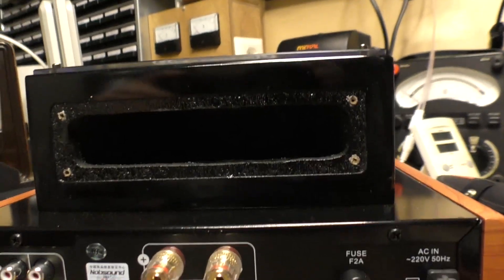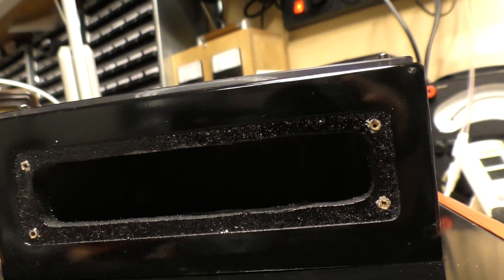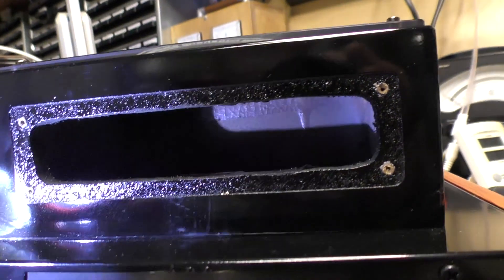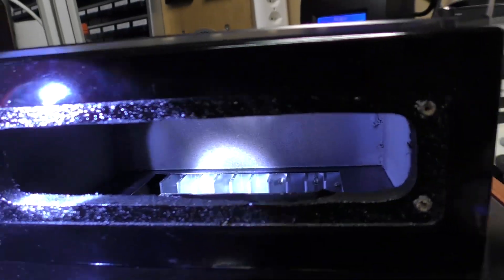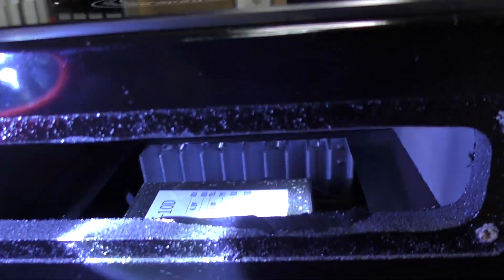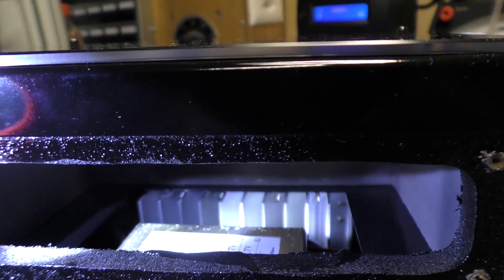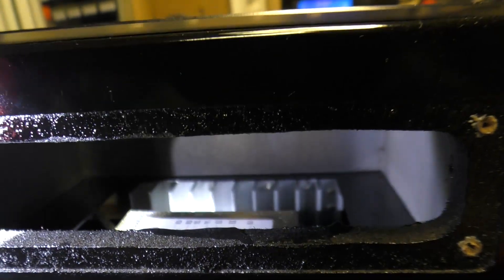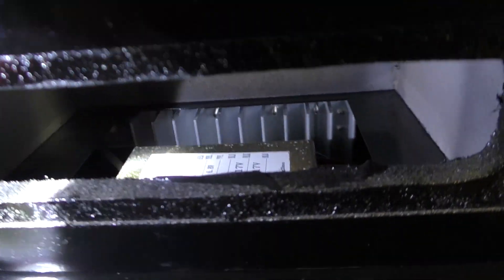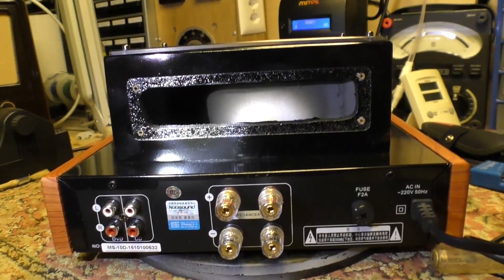And, well, guess what - this shroud is just a piece of MDF. And inside... there's nothing. Well, there is a mains transformer you can just see down here, and what looks like a solid-state heat sink over there. So these valves or tubes may not even be doing anything other than having their filaments lit up. It might just be a solid-state audio amp stuck on a heat sink. I need to open this up properly and find out.